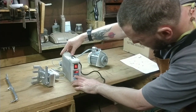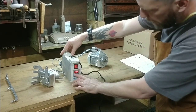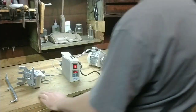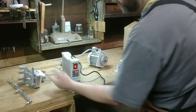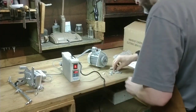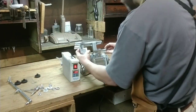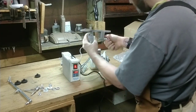On the left you can see the switch. I'm playing around right now dialing in the speed on the control unit. And that little motor on the right is the actual motor — tiny little thing. When it came in the mail I had serious doubts about whether it would have the power it needed. I've had some experience with these little DC motors. I've got one on a mini lathe and when you are going slow speed it's nearly impossible to stall. It just seems to get more and more torque as it goes slow, which is perfect for sewing machines.